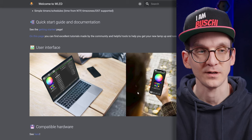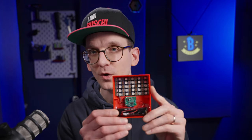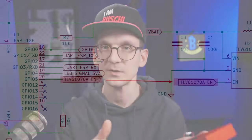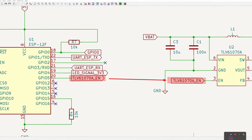There's already an app that I downloaded to my smartphone to give it a try. But the problem is that it will not work, at least not without changes to the source code for my boards. As I explained in my last video, I put a power conversion between the battery level and the five volts for the strip onto my board, and that needs to be controlled by a pin. On default it's off, and if you don't pull it up, the five volts will stay low and nothing will work. So I need to add this to the WLED source code, otherwise it won't work.